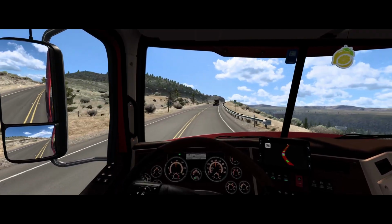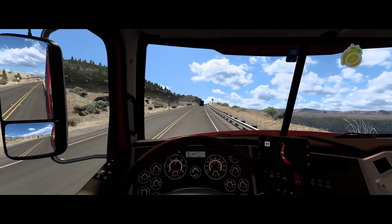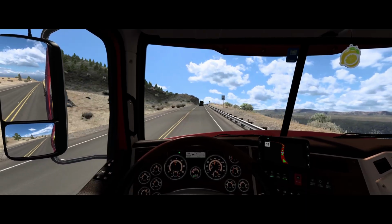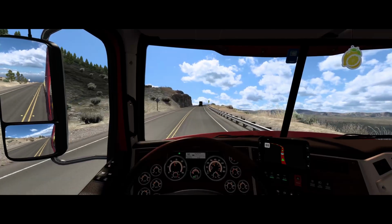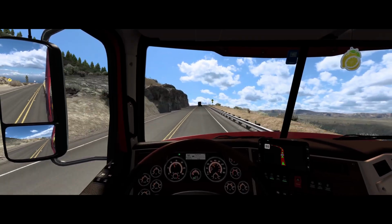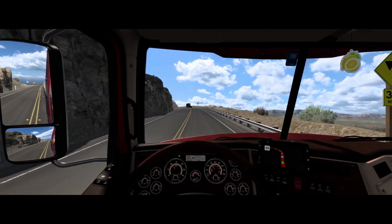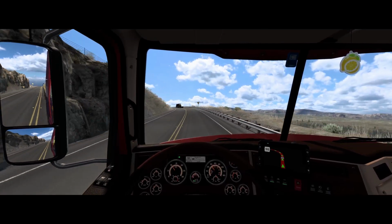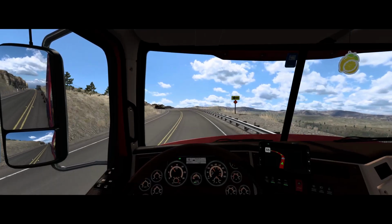Some more gradients, which is good, and it's the gradients that I really want to make sure that this engine shakes down as it should. So peak torque is produced at 1100 revs, and that's round about the engine speed when it's going to want to shift down. So any second now it's probably going to want to shift. Oh, look at that! It's looking down a little low.